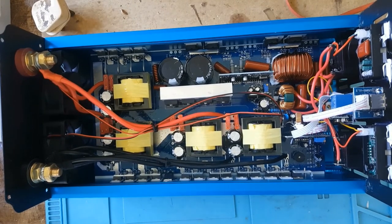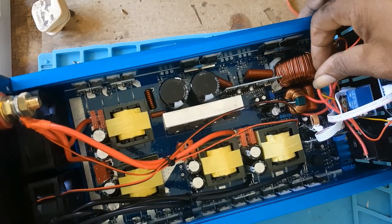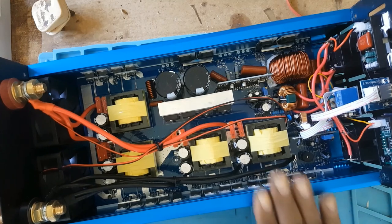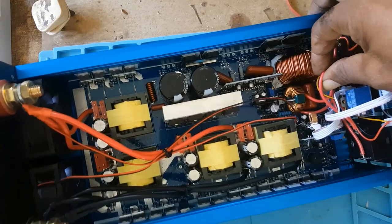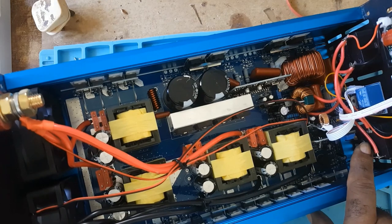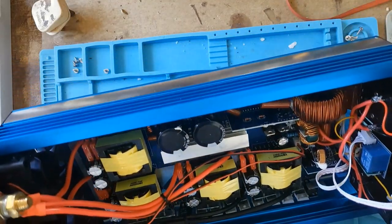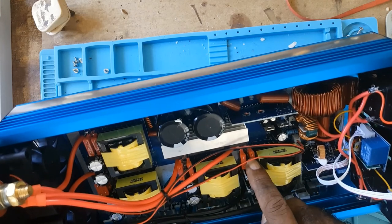I think I have everything there. Now one thing I noticed — for 3000 watts continuously, I'm not sure; I believe I might only get 2000 watts out of this. These wires are 12 gauge, both live and neutral are the same color. It doesn't have a ground on it, which is something I would have to add. It has eight fuses — two, four, six, eight.